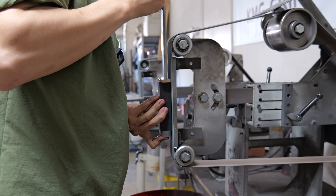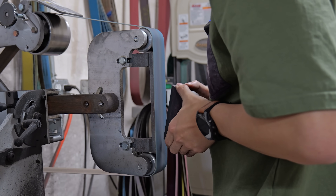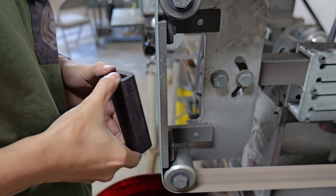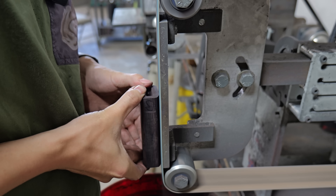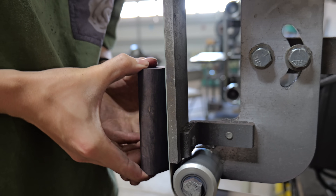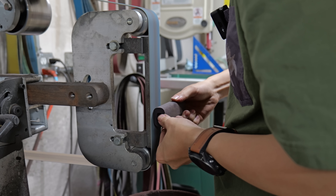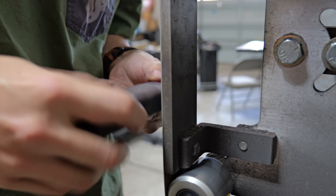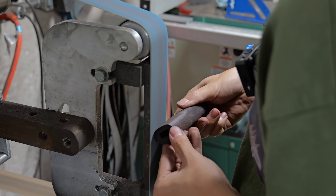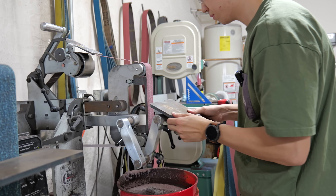Once I had the guard and pommel mostly profiled, I had to take the block back to the grinder and grind it straight again. Even though I tried hard to get that tang slot exactly parallel to the sides of the block, I couldn't make it happen — so I used the sides of the pommel and guard to make sure that block was square. Also, my dust collection system isn't running because I accidentally used it for metal, the sparks burned through the tube, and now I have to find better pipes or revamp the entire system.